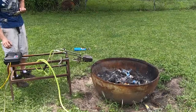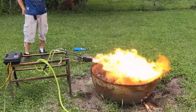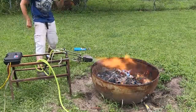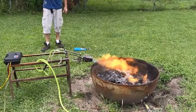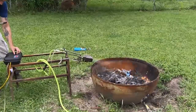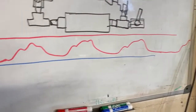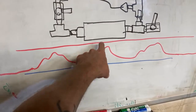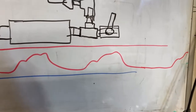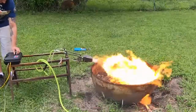The problem is the PWM. See how the flame is pulsating in a very uneven cycle pattern. When you turn it up high you can't see it as much, but when you turn it down, watch — see how it's sputtering? That's the PWM. It is putting out a sine wave in sync with those pulses, and they are not even. It looks like this — a strange bump to it, not the same distance apart — a very erratic sine wave. Bill, me and you were seeing this phenomenon on the oxygen burner we were testing.